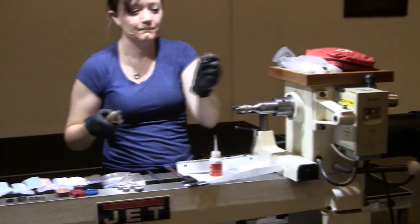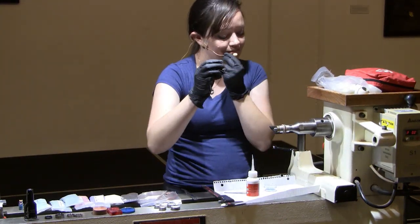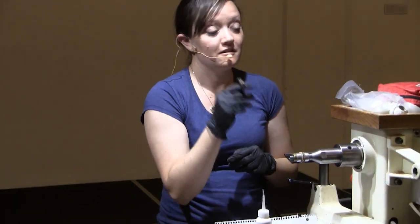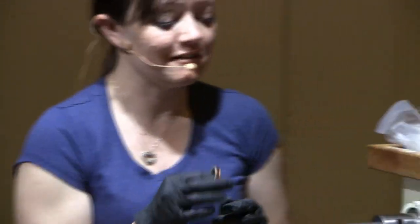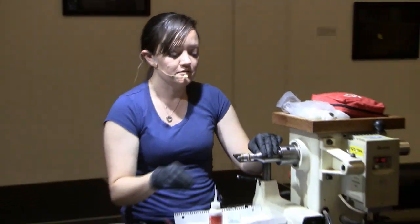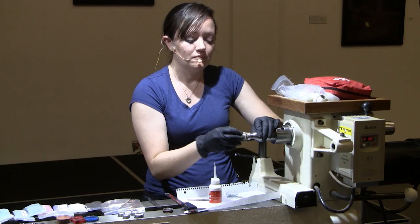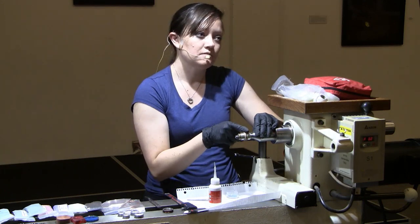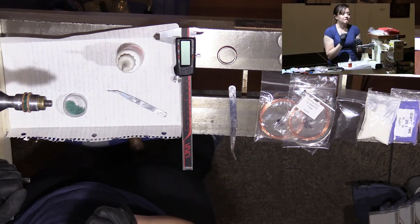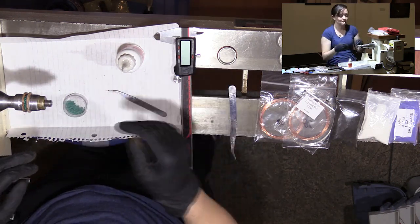This is where it gets a little bit more tedious - putting in the wire. I put the wire on one side already. What I do before I lay the wire is I'll start measuring again, because it never fails that I'm going to be a tiny bit off on one side or the other. Once I see where I'm going to cut the line, sometimes I have to cut more into stone, sometimes more into wood, so that they are absolutely equal. You think one or two millimeters won't make a difference? It does, because it is very noticeable when you're done, and then you have to redo it.